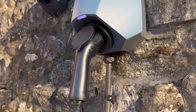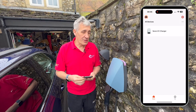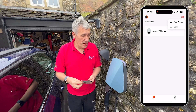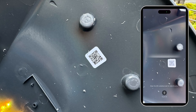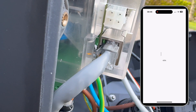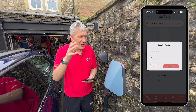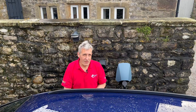Commissioning the charger is a straightforward process. Once you've downloaded the Seren app and set up a user account, it's just a case of scanning the QR code — either underneath the charger or inside the electrical cover, which we used so we could also check the data connection back to the ethernet port via the flashing lights at the same time. I'll leave a link to the charger in the description — let us know what you think about this installation, the challenges we've had, and any other questions you have about EV charging.